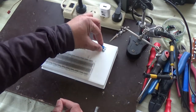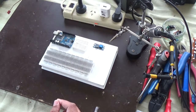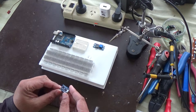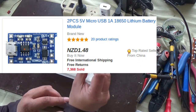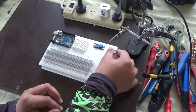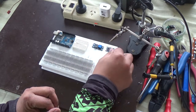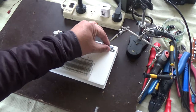From the load output of the battery charging module, we go to the on-off switch. From there, we go to the step-up module that gives us a constant 9 volts at its output, regardless of the 18650 battery's terminal voltages. Because I'm adding a component tester that requires a 9 volt supply, this is why I selected 9 volts from